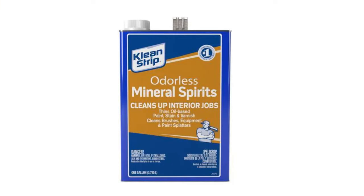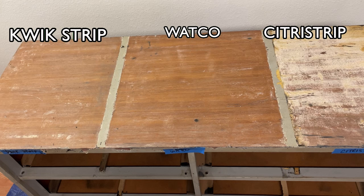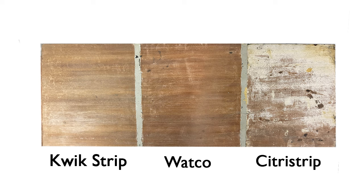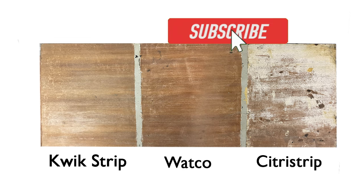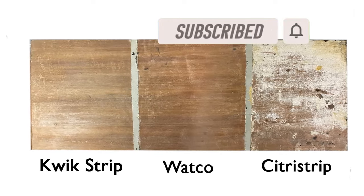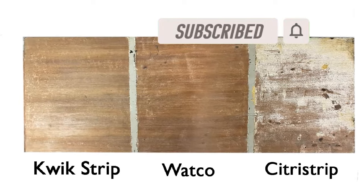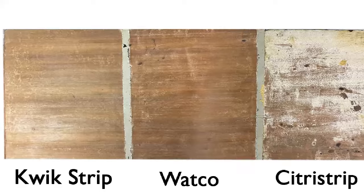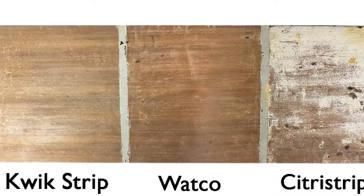The last thing I did was to clean the entire dresser with mineral spirits using a steel wool pad as required by the three manufacturers. This is what the dresser looked like after it was cleaned with mineral spirits. Obviously the Citrus Strip did not remove all of the paint and old finish. Even though Watco seemed to do a better job after the first application, Quickstrip made up for it after the second coat was applied — sections one and two with Quickstrip and Watco were tied as far as I was concerned. They both did a great job at removing the paint, primer, stain, and finish that had been on the dresser for at least 10 years. And best of all, the entire process only took about 90 minutes.